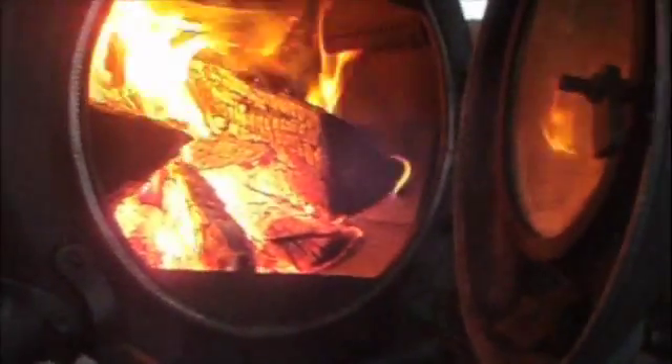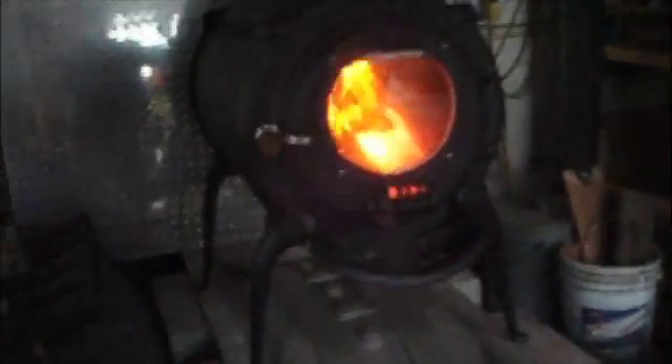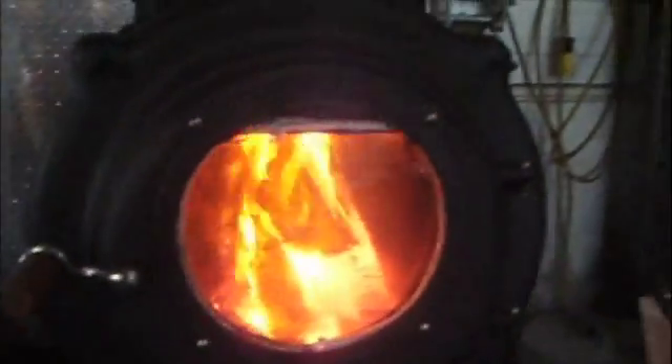If you can see, there's a stainless steel tube on each side with a bunch of holes in it. This is the secondary combustion system. If I go around to the back side of the stove, there are two tubes that enter the back and basically draw in air from the room. The air becomes the same temperature as those tubes — which is in the low 700s — and at that temperature it will mix with the smoke in the stove and ignite the smoke, getting a cleaner burn.